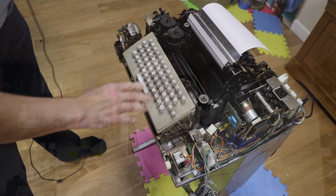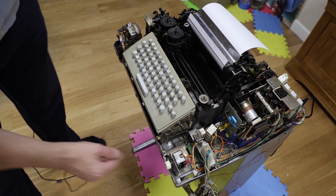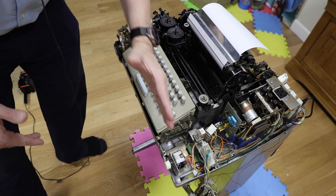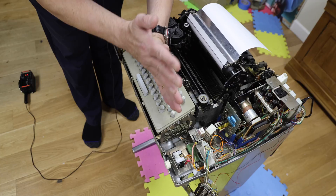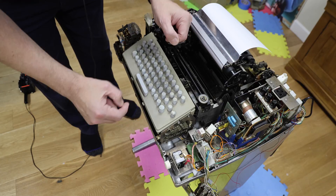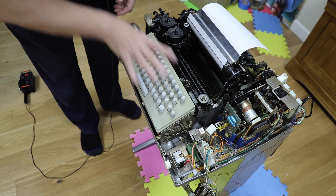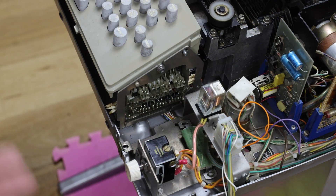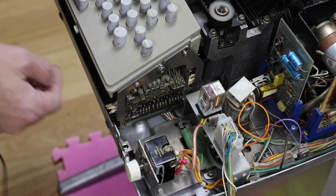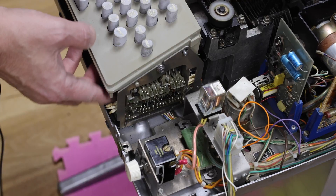What's really amazing is the keyboard is entirely mechanical — it has no electronics at all. When I press a key it forces a pattern on here, done by a load of bars which work in pairs and all of the keys have a bar with encoded notches. So when you press a key it forces a particular pattern of ups and downs on eight bars that go across here. For example if I press an A you have this pattern. I can manually reset it and press an O and I get a different pattern, or G.